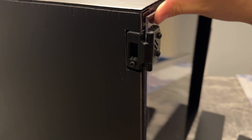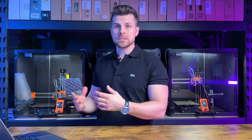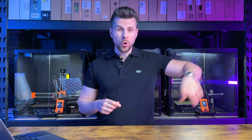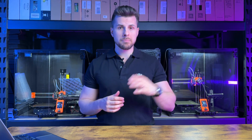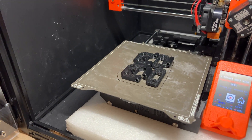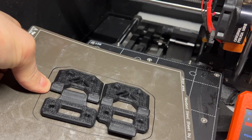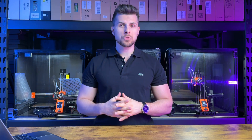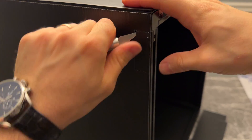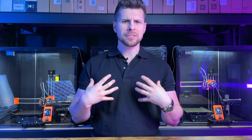Finally, for the front doors I used polycarbonate panels. If you want to save a little, look at local marketplaces — I found a local guy selling 4x8 feet panels for 50 bucks each, quite a steal. The front panels will need hinges. I like Simon's VZ-Bot ones that I use on his designs — thank you, Simon. You will need to print 4 of them, 2 per panel, plus some hardware to secure them to the aluminum frame.